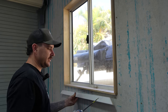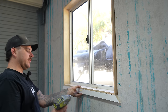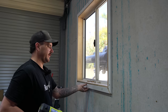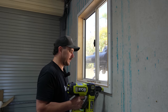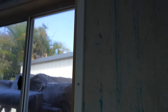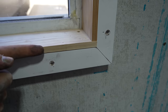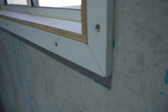Just cut these little trim pieces — now that this is overhanging 20mm we're going to screw this piece of board under it and that is going to finish off the frame. I actually completely forgot I had this nail gun and I think it is going to hold this up and look a lot better. That is much better — looks a lot better with a nail gun rather than having those screws. Normally you would have this board a little bit shorter and this board comes up and covers that seam, but I think that still looks fine and that's all I could get at Bunnings at the time.